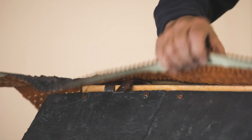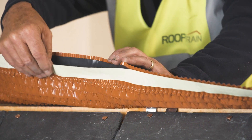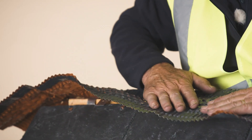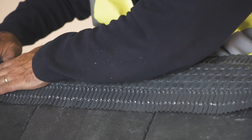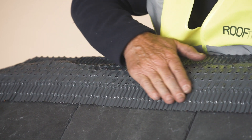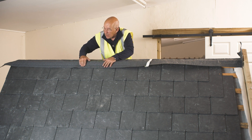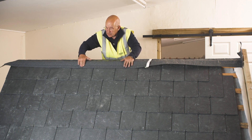What we do now — you have the sealing strip there, the sticky bit with the paper on it. Take that paper off and put it up over your side, get it down. Continue to pull it through. Don't try putting it over like that because it will stick and you'll get a bump. You need to work it through nice and gently and stick it back through.